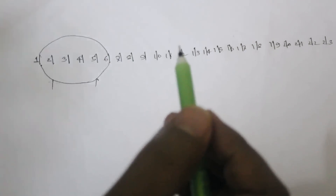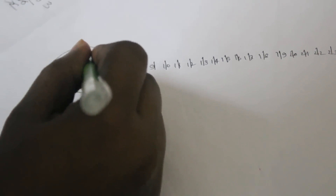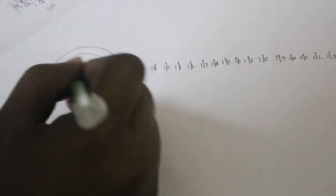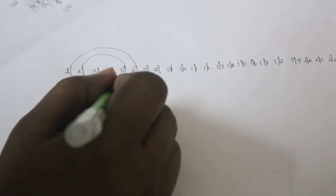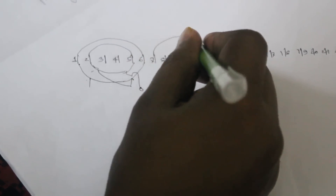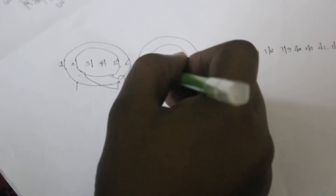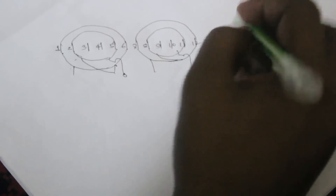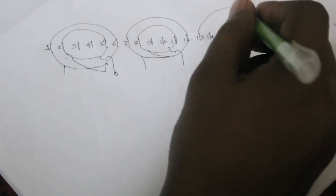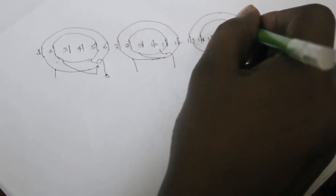The running coil makes a full pole with 2 coils, so the second coil is smaller. The finish terminal of this coil connects to the start terminal of the second coil. The second coil goes from slot 7 to 12, and here is the smaller coil. The next coil goes from slot 13 to 18, which is also a small coil.